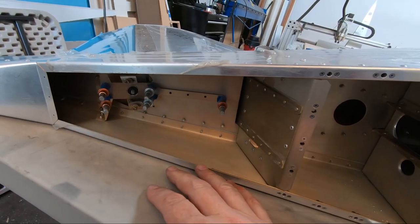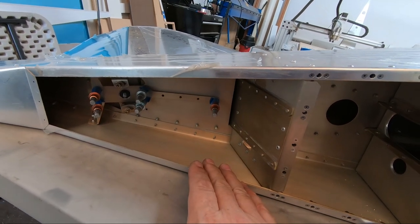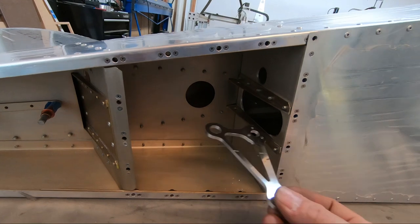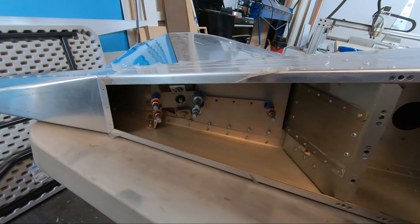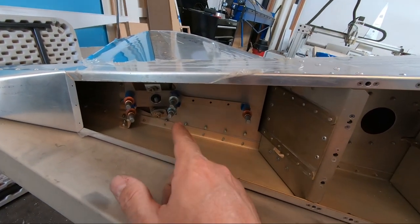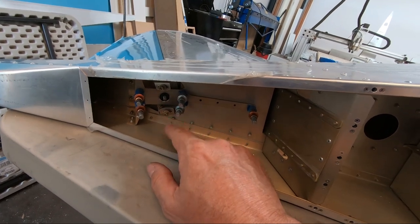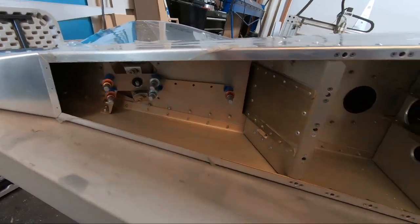As long as I can finish all of this, I'll feel comfortable going ahead and attaching the rear fuselage to the forward fuselage, knowing that the only thing I really have to do is come back later, attach the rudder cables to this assembly, and then just bolt in this bell crank assembly — which can be done afterwards. Let me start taking some of this apart and figuring out what hardware I need. I'm going to get this bell crank assembly cut on the CNC machine — it gets two bearings in it for the rudder cable attachments to the rudder.